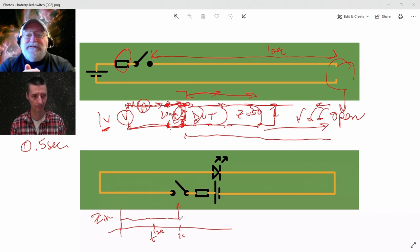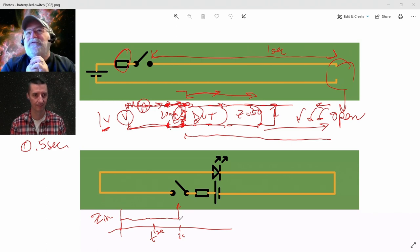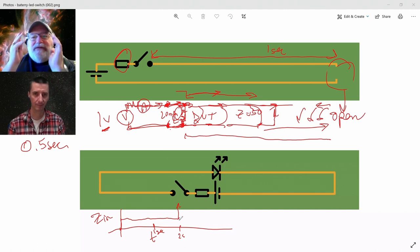And now let's go back to the Earth and the Moon: 450,000 kilometers, 1 second one-way time delay, 2 second round trip time. In those 2 seconds that I'm doing the measurement, my very slow digital multimeter, my very slow ohmmeter, is going to measure the input resistance of 50 ohms, literally with an ohmmeter, because that's how it behaves. It looks like a resistor at the front end, because I have a constant voltage applied and a constant current, and that is the very definition of a resistor.